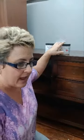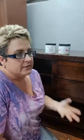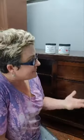If you had a piece that had any kind of a stain that bleeds through paint, and I could come up with some that are gross, there are some stains that you just can't get up. They want to bleed through paint, so you Boss them. Okay. The thing about Boss is, if you think you don't need Boss and you paint a layer of paint on, and then you start to see spots, like on a table, just spots of bleed through coming through, you don't have to Boss the entire table.